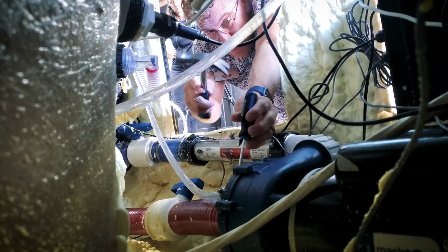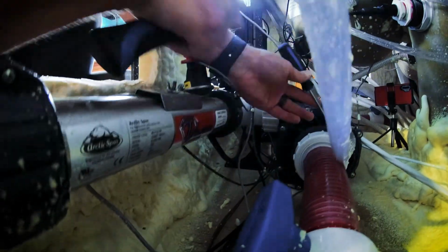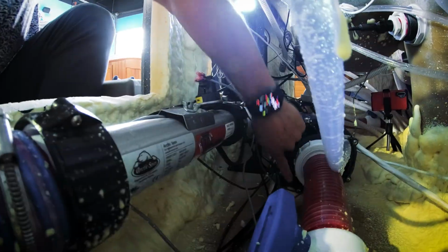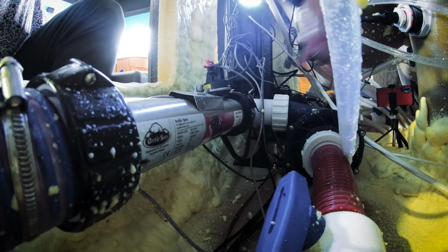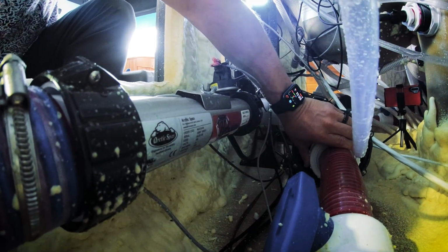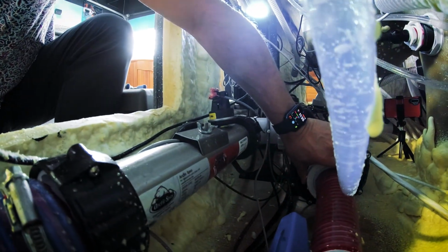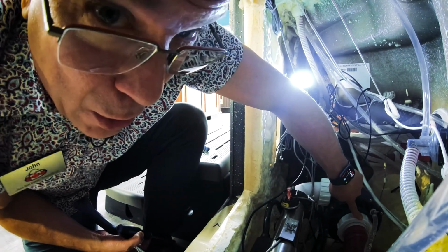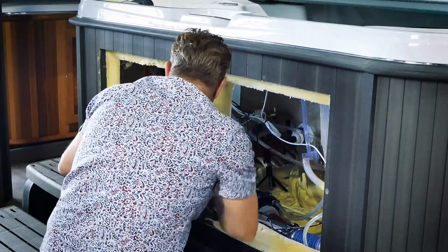Now, it's interesting, I'm calling that a leak, just so you know from warranty purposes and stuff like this. This is something that as a customer, you should be checking your unions quite regularly to make sure that they're not dripping. Because with the vibration of the pumps, with the heat and expansion and contraction, sometimes these loosen off a little. As you can see, this one was quite tight, but these can loosen off and you can get a little drip there. If you call the service department saying, I got a leak, and we come and tighten your unions, you're going to get a bill. So if you don't want to get a bill, tighten this yourself. So open up your cabinet from time to time and check it.